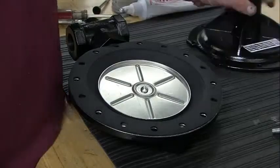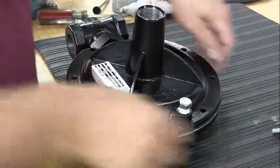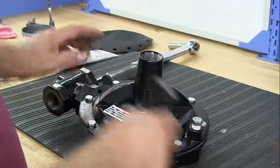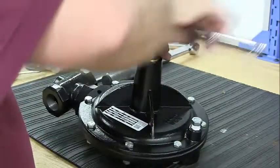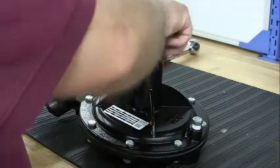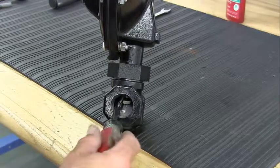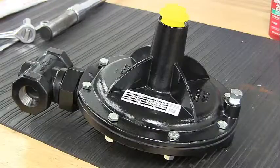The next step is to reattach the spring housing. The cutout will go around the union nut. Place the spring housing so that the holes are aligned, then place the bolts and nuts in. Use your half-inch wrench to tighten. Insert the spring and adjusting screw through the top, tighten, then screw the cap back into place. Ensure the aspirator tube is straight and centered in the waterway. If it is not, use a screwdriver to move it into place. Your valve is now complete.